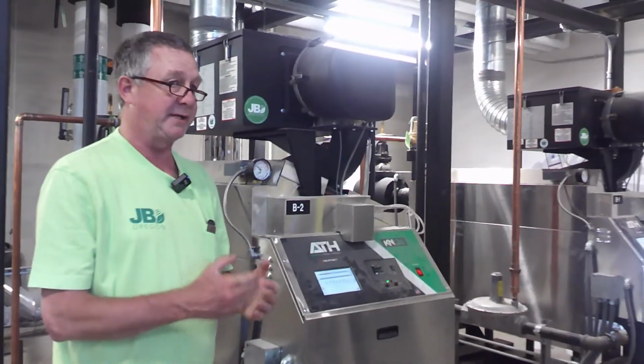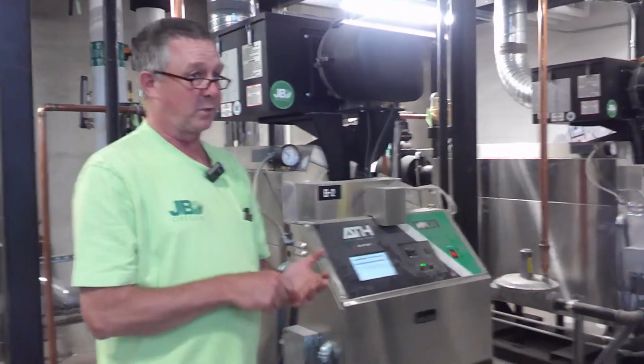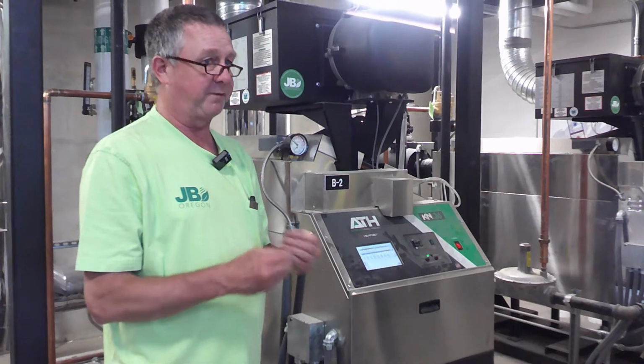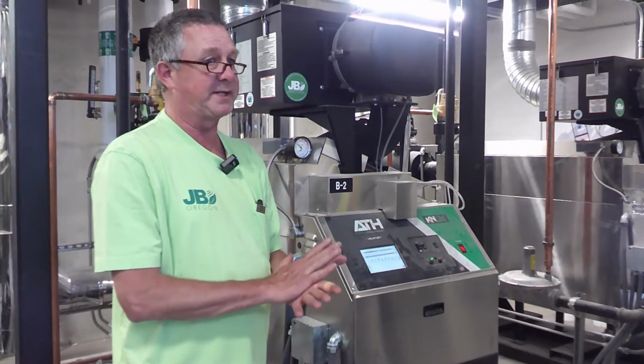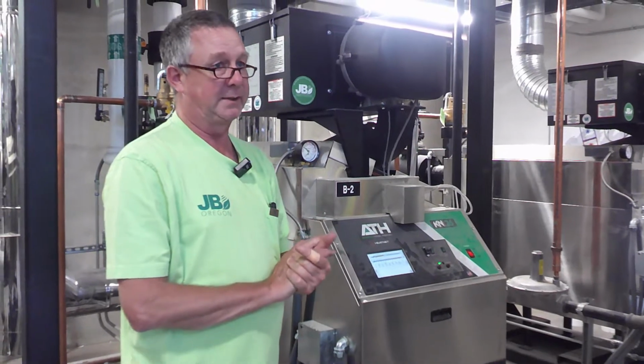Can you wash these? Yes, but I recommend taking an air compressor, blowing them out first before you put water to them. If they're caked in dust and you put water to them, the media is fairly fine. It may turn into a concrete stepping stone, and that filter is no longer filtering.